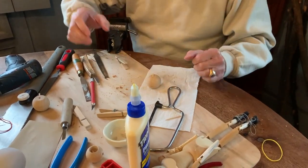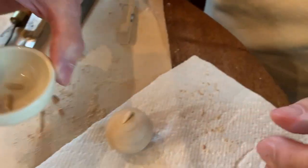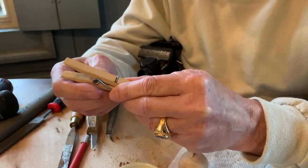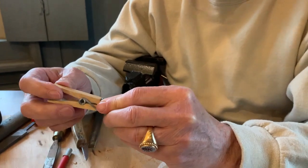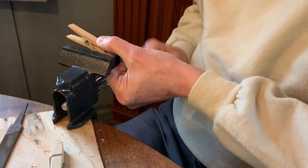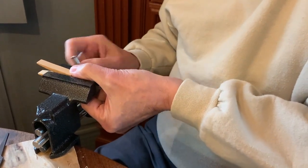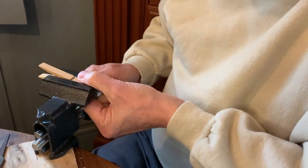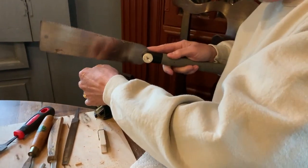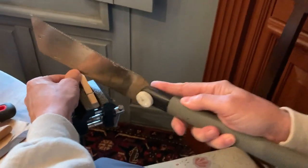I tried to figure out a way that you could do it at home with the least amount of difficulty. One of the things you can see here is I have a little dish with noses in it. It's easy to make the nose — just take an ordinary clothes pin. You already have a nice squared-off bottom. Put it in a little vise because it has to be cut, then make a nose shaped like a triangle using a simple back saw. Get on an angle and cut the nose, using your thumb as a guide.